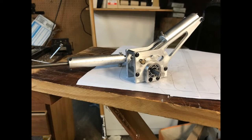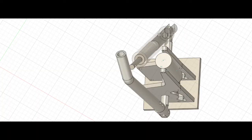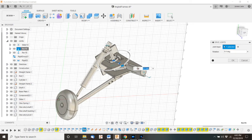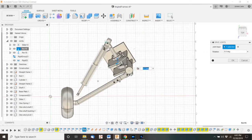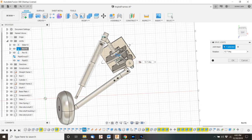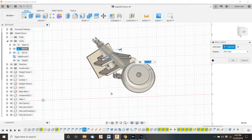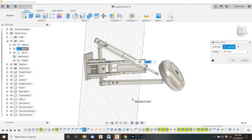Finally, we settled on a design in which the pneumatic cylinder is parallel with the center line of the aircraft. It pulls up and down on a lever that turns a center shaft connected to the main gear strut. When the gear retracts, the main and oleo struts lie just next to the actuator inside the gear well. A locking slot on the top and bottom lock the gear up and down. We made a mock-up of the aircraft to test the landing gear before we made the fuselage of the airplane. That way we could be sure the gear would work correctly when installed in the airplane.